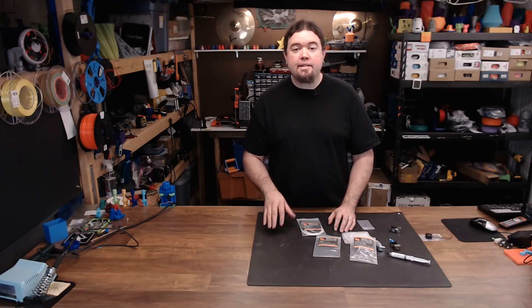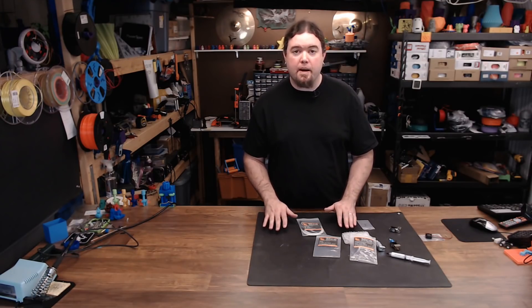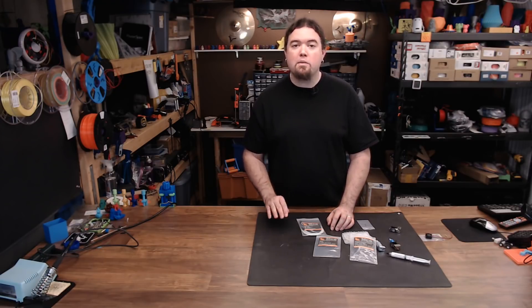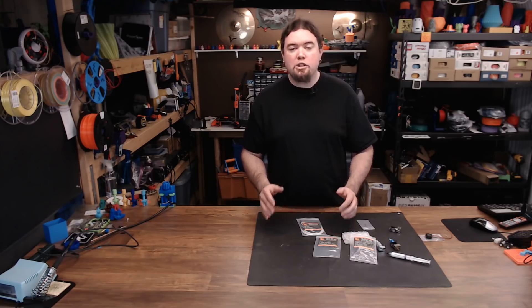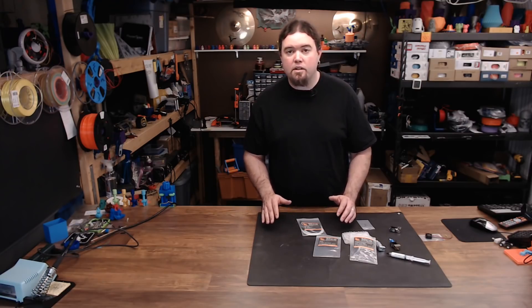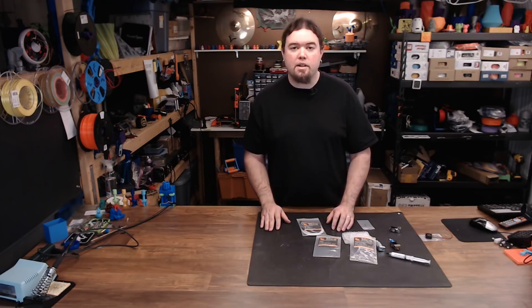While testing the hot ends, I wanted to keep things as consistent as possible. I used identical spools of filament, all the same slicer settings, and the G-code was just copied to both printers — it was the exact same file. I decided to keep the 0.3 millimeter retraction distance and do a couple of other models just to see how they'd turn out in comparison. There is a document in the description below that shows more in-depth test results if you'd like to check that out.